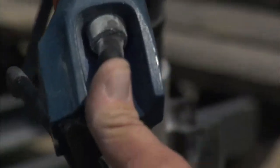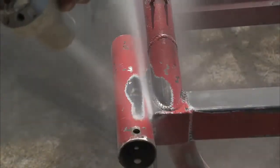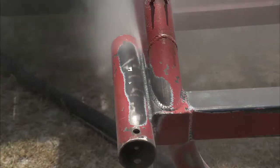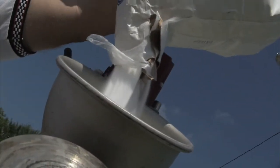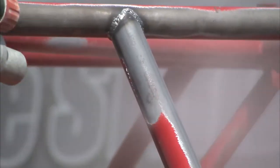The Stripco machine also has a remote adjustable flow control which makes it inexpensive to operate because you use a lot of air and just a little bit of Soda Blast medium. We only had to use one bag of Soda Blasting material per hour, which made it very efficient and much easier than other forms of blasting.